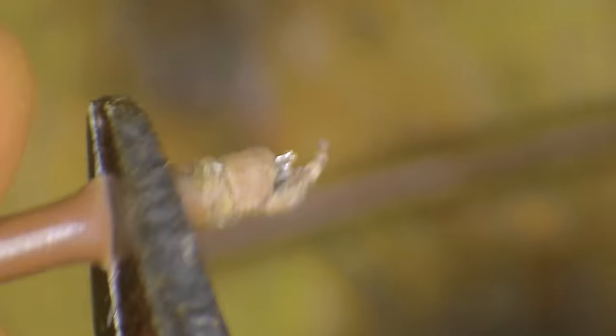Let's do that again on the other end. We hold the soldering iron onto the copper pad and onto the wire to transfer heat to both, then melt the solder — melting onto the pad and onto the pin as well. Another lovely neat and tidy ball. Cut off the excess. I've done that without any extra flux, other than the flux that was in the solder. I would recommend using a breadboard like this to practice and keep practicing getting nice blobs when you're soldering.